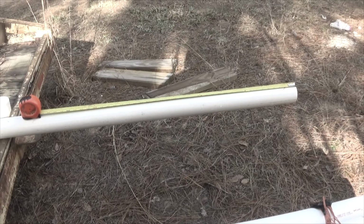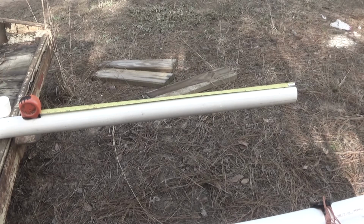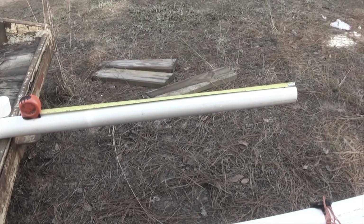water inside the well that's going to be filled in. So we can put that cap on full strength. There'll be no holes in the cap as such, and then the holes will start 1 inch above the cap and will continue along. So adding the 1 3/4 inch and then the inch, we have more than enough length of pipe and depth of water to pull all that in. And again, there's no problem if the water level dropped a little bit because his pump is going to be set down here well below the 3-foot level.